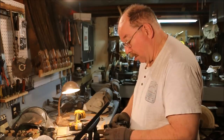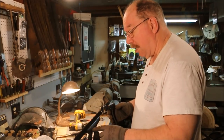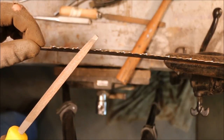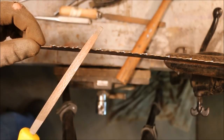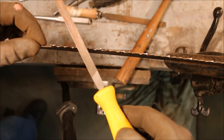One day later. I'm using this standard Stanley 42 to set the teeth and I'm just going to go along and do the alternate bevel teeth. I filed the alternate bevel teeth with the first cut going this way and then the second cut going that way.